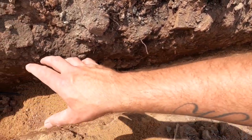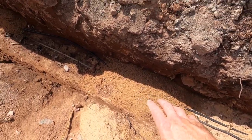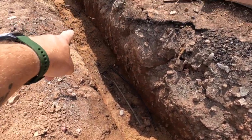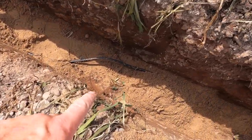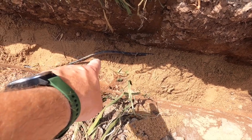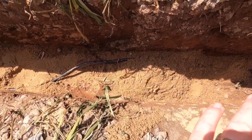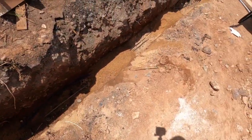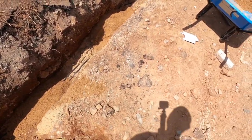So what I'll do is put it in piles to hold the cable down in the highest spots and then work my way back. You see where there's a big lump there, there's also a hump in that which is there, so I'll be in there and I'll get Kian to drop some more down on there while I hold it down on the deck, and then fill all that in, walk it down, make sure there's plenty over it, and then it's ready for the gas mains to be going in.